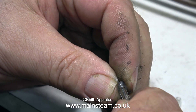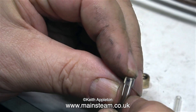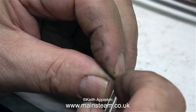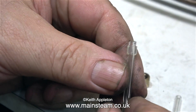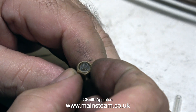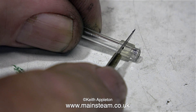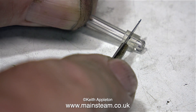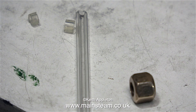I've cut a bit of this small silicone rubber tubing using a pair of scissors, and now I'm pressing it onto the glass tube. And you can clearly see why I rounded the edge of the glass tube — I did this for two reasons. Anticipating putting a piece of rubber tubing on the end of it, it would have cut the rubber tubing, and also it would probably have cut my fingers. Here you see the piece of silicone rubber tubing on the glass, but it's too thick. So, using my scalpel, being very careful not to score the glass, I rotate it and cut it into two pieces.